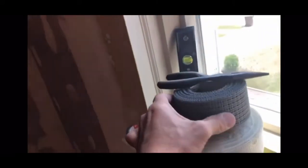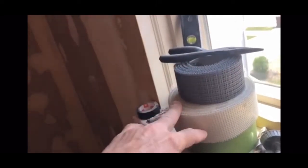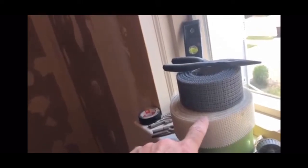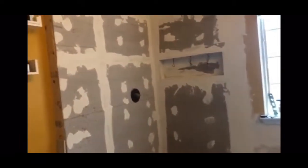Before I did this I prepped it with a mesh — I have videos on all these so check my channel. Make sure you get the right mesh because this one's for drywall and this one is for backer board. Don't use the drywall one because when it gets wet it will start to break down in about three to four years. There is another product people use — it's fiberglass mesh; it almost feels like paper.